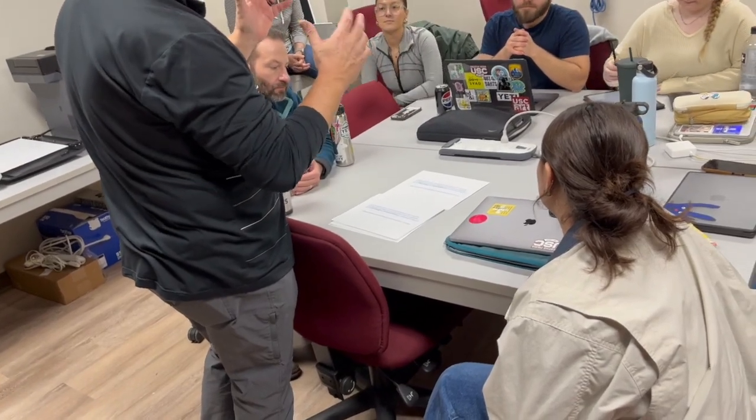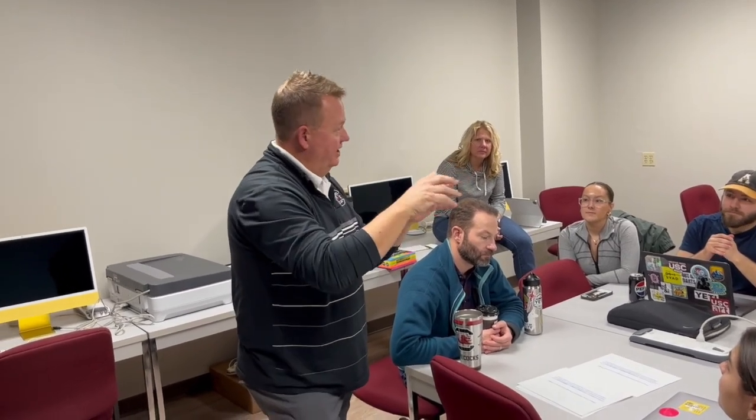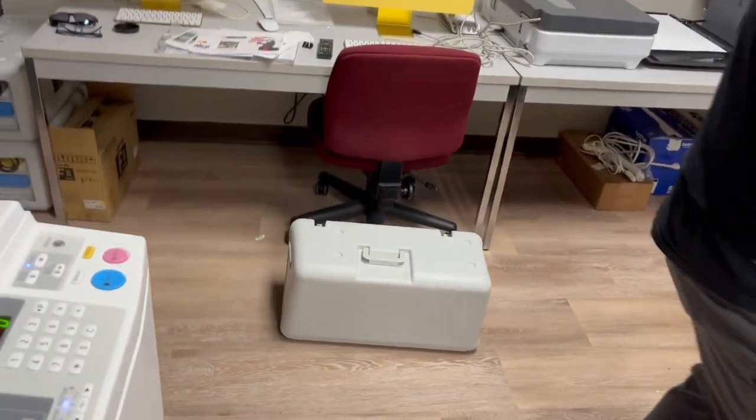You can play around with speed and actually get more color variation — turn that blue a little lighter or darker. When using a printer to bring things over, you can do patterns and different screens, which changes the colors you'll get. You can stretch that gamut out a bit by playing with screens. There's no rule I can give you because color is in the eye of the beholder — 30 years of experience tells me that.